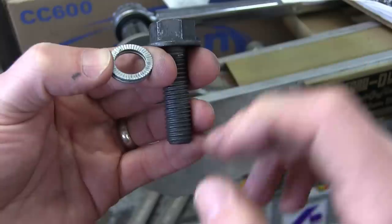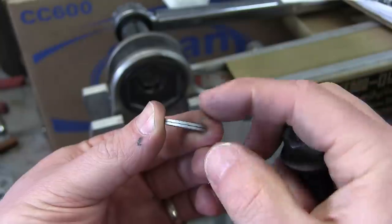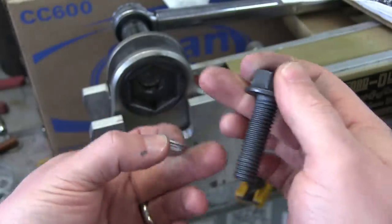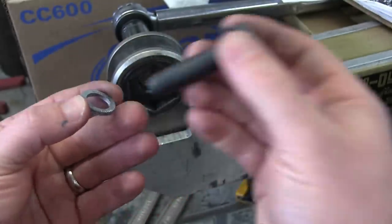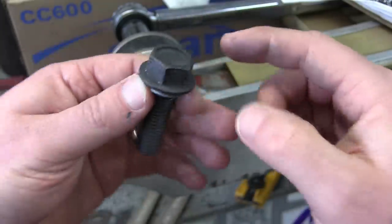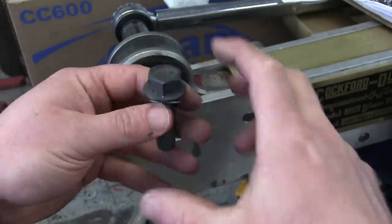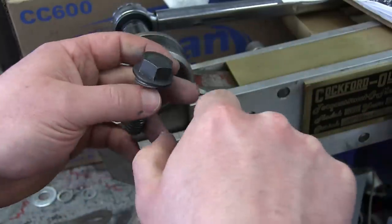So if you move this a quarter turn, it backs off a certain amount, but this actually raises up further than that amount. In order for you to back this bolt off, you actually need to either have it slip on these serrations — which you do not want, and that's why it wasn't working when we tested it with the hardened nut and the hardened bolt. What you want is for these serrations to bite in, and these serrations need to expand — to click over to the next one. That means we physically need to stretch this bolt out. And that is why this works so well: because the angle here is shallower than the angle in betwixt here, and we need to stretch the bolt out in order for it to overcome this lip here — to overcome this lip in order to loosen off. We're torquing it in reverse; we're stretching the bolt out to overcome this fastener.